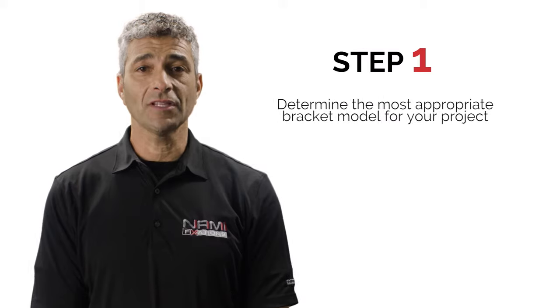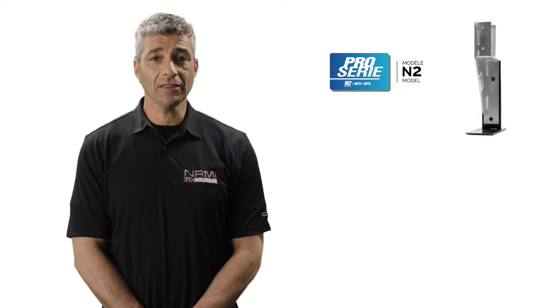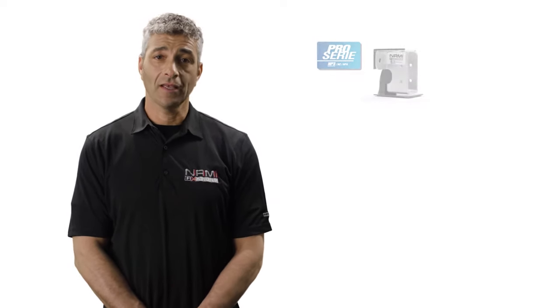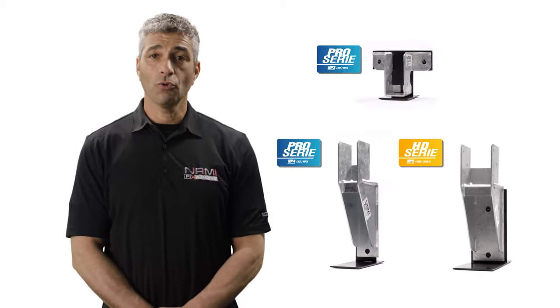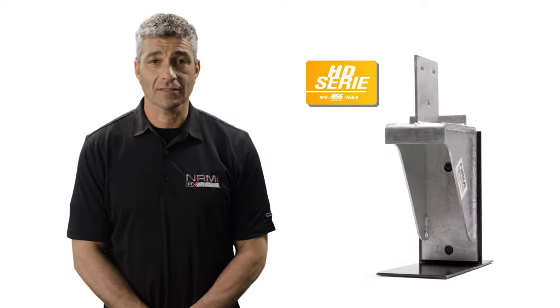Before you purchase any brackets, the first step is to determine which model is best suited for your project. For a beam parallel to the foundation, you must choose the N2 or N1200 model. For a beam perpendicular to the foundation, you must choose either the NP3, NP4, or NP5 model. For a structure in elevation, you must choose the N56 model.